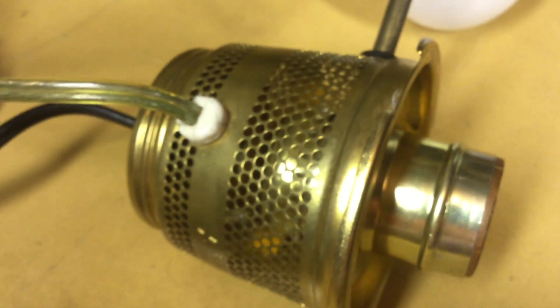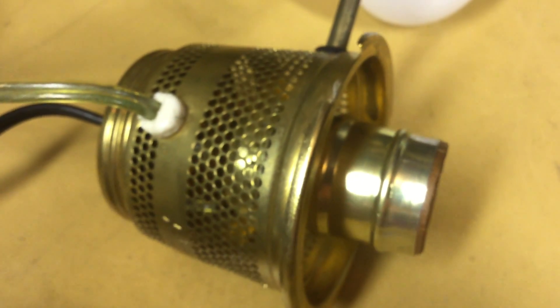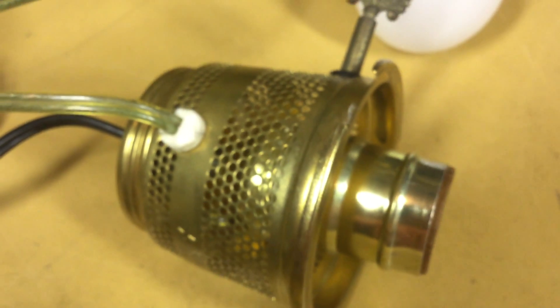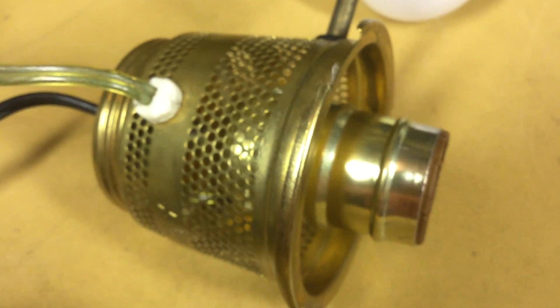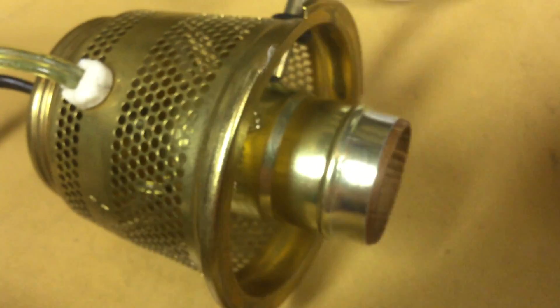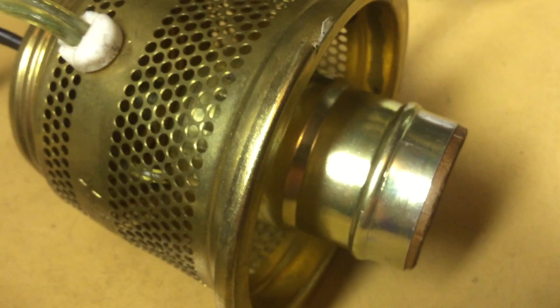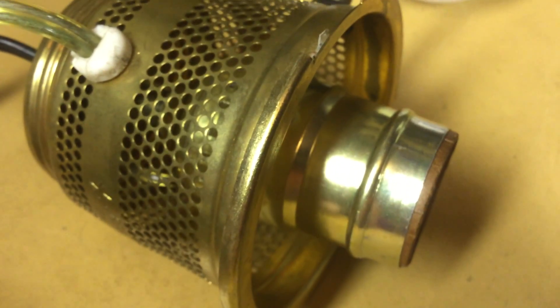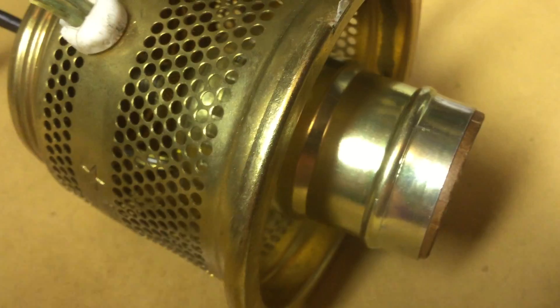Like that first lamp I bought with the Model 12 burner — it had real nice smooth gearing for the wick riser and it worked real well. It can sometimes be annoying: you'll buy what looks like a really good Model 12 burner, and it turns out the gearing is messed up. The forces needed to move the wick up and down sometimes place a lot of strain on the gearing, and if someone tries to force it — especially if the lamp's been sitting for a while and everything is gummed up — you'll damage those gears and then it'll bind on you. So if you've got a burner that works real nice and smooth, and the wick riser doesn't have bent teeth or anything in the gearing, please don't cobble it up.